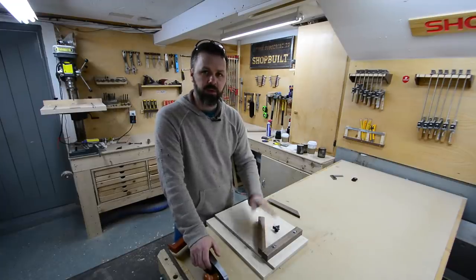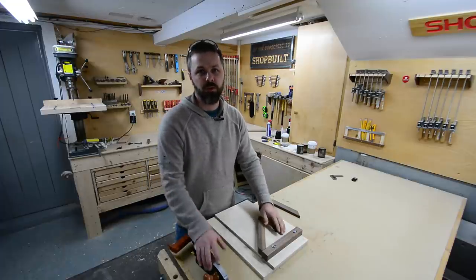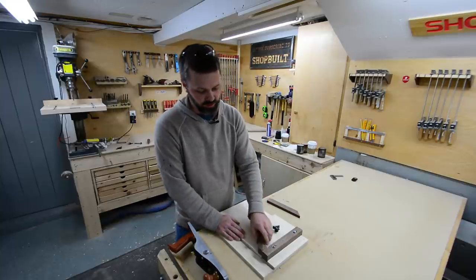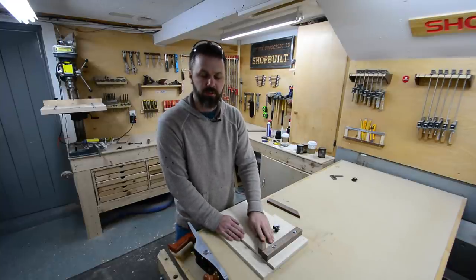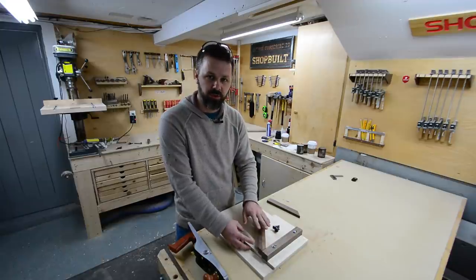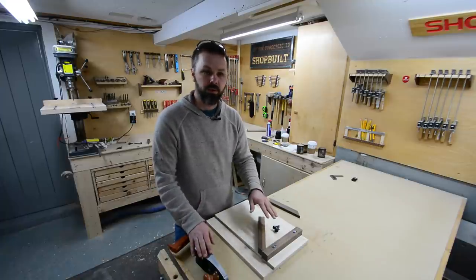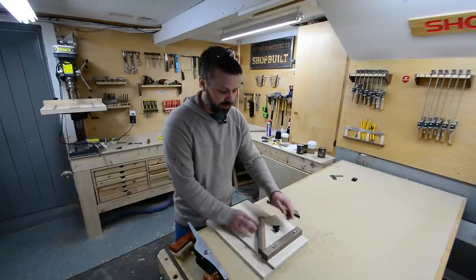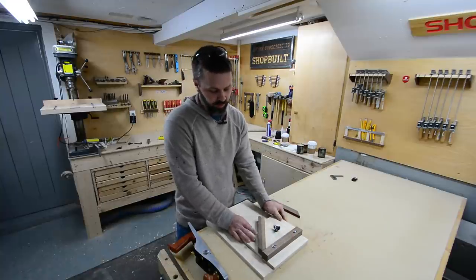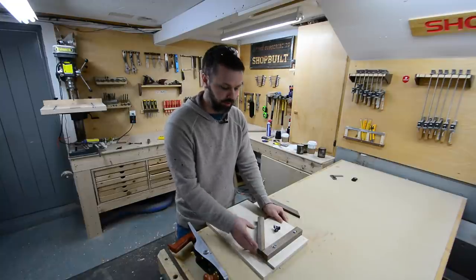The idea behind the fence for the miter is pretty simple. I just cut a piece of plywood on the chop, so that gave me the rough 45, and I did the same thing with the fence. Then I could put that rabbet right on top of the fence and dial that in with my combination square until I get a perfect 45, then put some weights on it and waited for the glue to set. To use it, it's got the same premise as the other fence — you can move it in a little bit further as you wear out the end to keep that zero clearance.